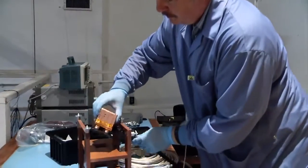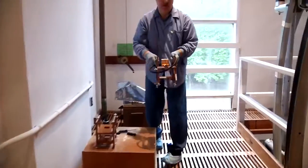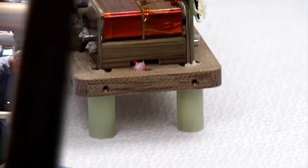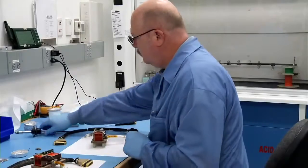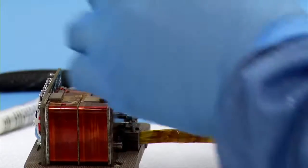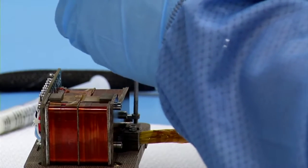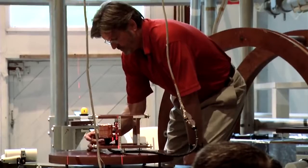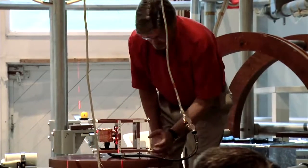The magnetometers, even though they're small, simple-looking instruments, there's actually a great deal of sophisticated electronics and testing and calibration that goes into building them. They're so sensitive that we ask everyone to use non-magnetic tools when they're working on them. Even if you had a tiny little fleck of metal that came off of your screwdriver, that would be enough to be noticeable and detected by the magnetometer. There's no Maytag repairman in space, so we punish these instruments before we pack them up and launch them, because we're not going to see them again, and we have to make darn sure that they're going to work.